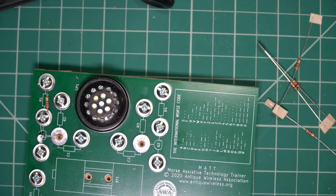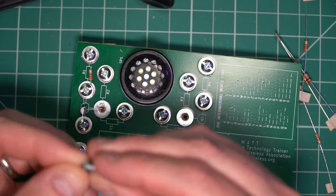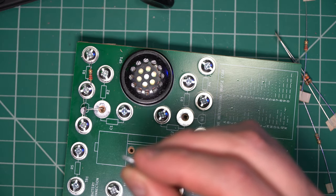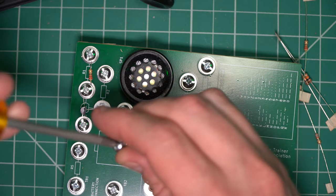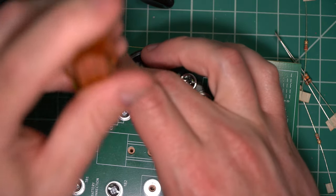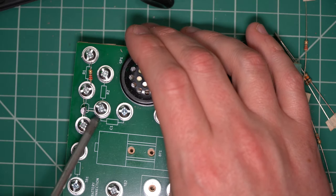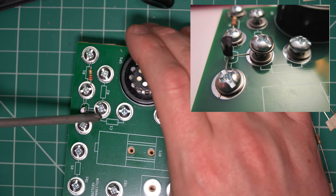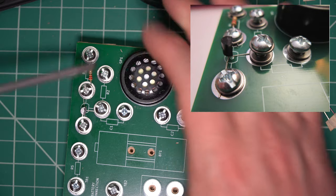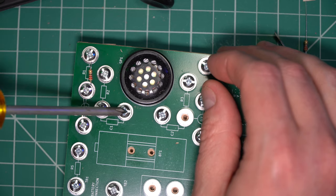Clear up some space. All right, now this one is a special screw where we need to put a washer on top of the lowest component. And there's gonna be a wire that goes in between. So we're gonna entrap the transistor. So two washers just went on. The transistor is below the lowest washer. And then R2 and C1 will go underneath the middle washer before getting locked in. And remember, we're going to entrap them using these screws, tighten them down on both sides before we try and work with the middle.